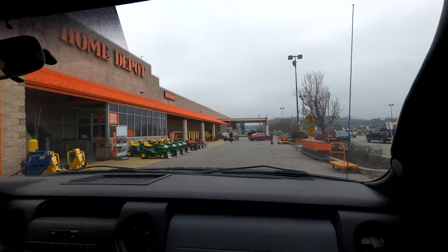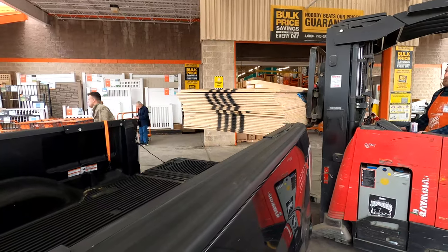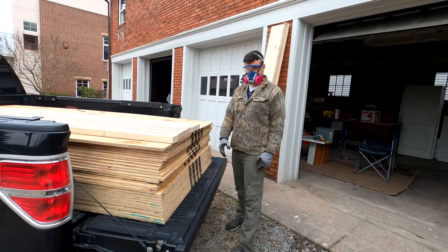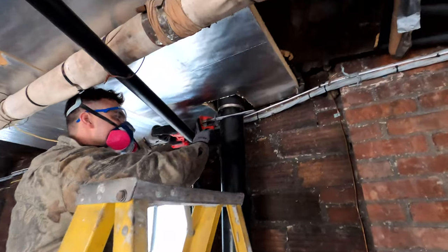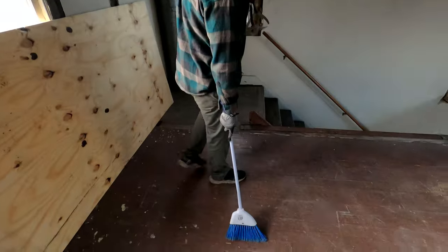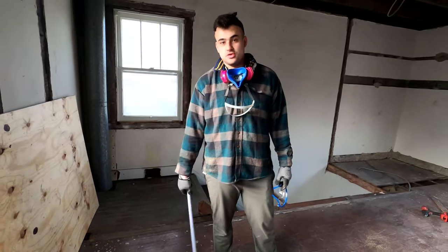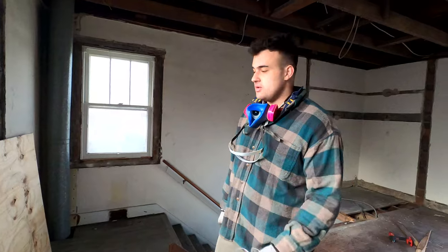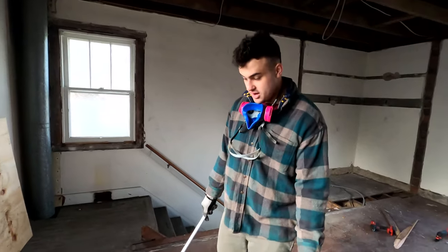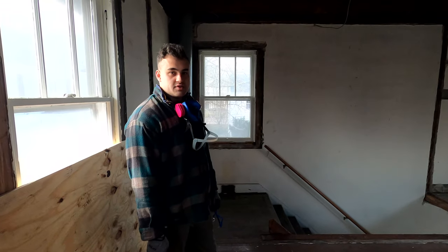For our first piece of plywood, we're making sure the area is clean and well swept - we don't want any squeaks in our floor. Me and Jared use a lot of glue and a lot of screws; we don't usually like nails because over time they'll pull out and that's what causes squeaks. We also go around the area we're about to put in and step around to see if we hear any squeaks. If so, we try to put a screw in before we put the piece of plywood down.